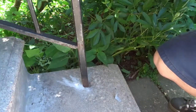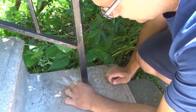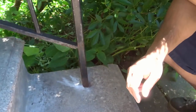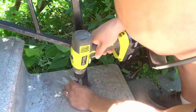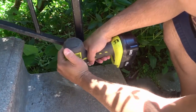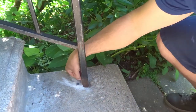Just like that. We can now take off the respirator. I'm going to put the L bracket in place just like that, get the Tapcon bit, and this goes right into the concrete. We're going to try and hit it at the same angle I was drilling at, which is a slight angle. Let's get this in place. The Tapcon is in and the L bracket is secured to the concrete nicely.